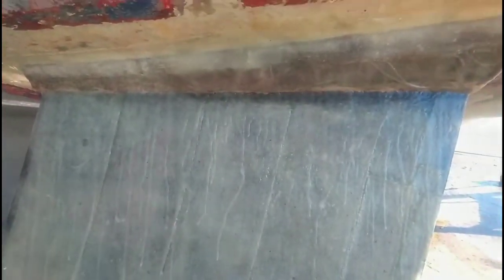The underwater sealant is on the port keel. There's a layer of epoxy which needs 48 hours to cure. I'll be coming back, abrading that, and then sealing it up. It'll end up looking like this one here. This one is also having a 48-hour period because it isn't that warm yet, and then I'm going to abrade it and apply underwater primer.